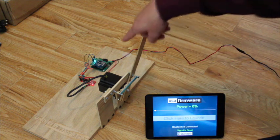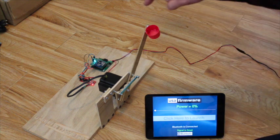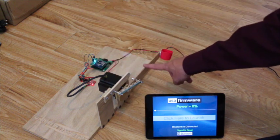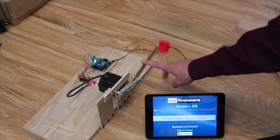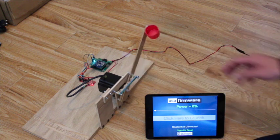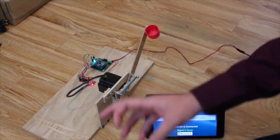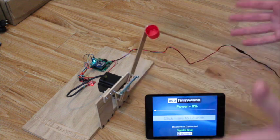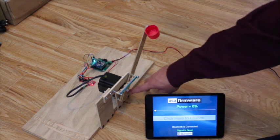The electronics include an Arduino with an NRF8001 Bluetooth module, a little Easy Driver stepper driver, and a big stepper motor. It basically pulls the arm back, and when you click launch it releases the enable pin — rubber bands pull it back and launch the projectile. We had a group of mugs as targets with a ping-pong ball, and if you made it into a mug you won it.